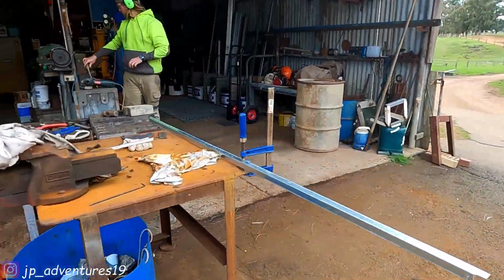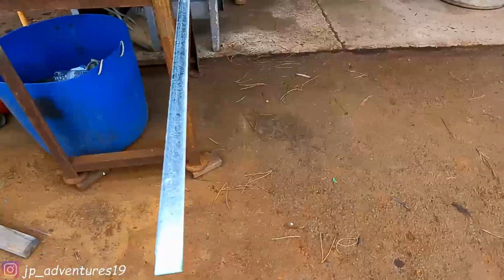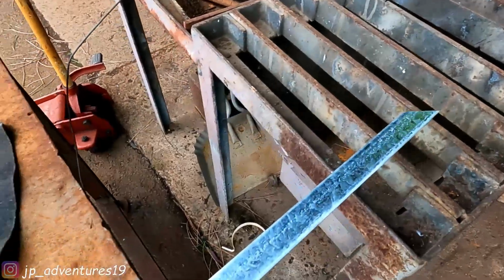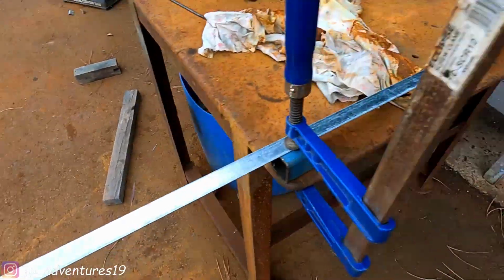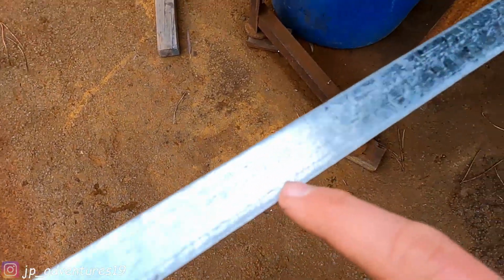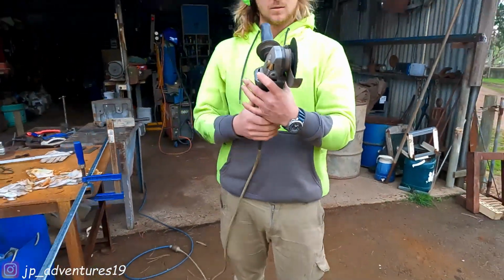Now we're at the trickiest bit. So we've done this side. The thing is that the trims of the hatch to the garage and the balcony overlap, so we have to adapt them a bit. And now Patrick will actually have to cut out a piece of this one, which you might be able to see here. There's the line all the way until here, so he will have to cut it out, and we just use a cutting disc and the little grinder today.